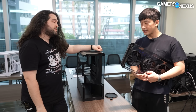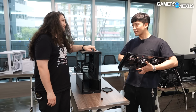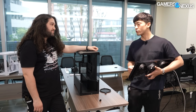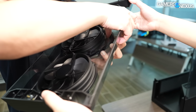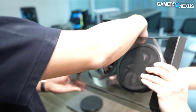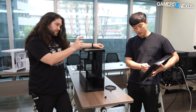Just for a curve. And then if you're talking about drilling holes and then making a curve, we're talking about at least 5% more failure. Yeah, but we will test to see how that goes. But the manufacturer is confident if we follow the rules, where you have to leave the gap between the cutting holes and the edges at least 3 centimeters. So 3 centimeters here, 3 centimeters here.